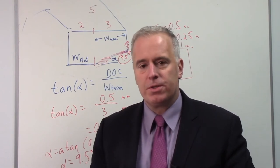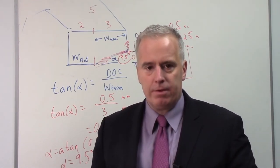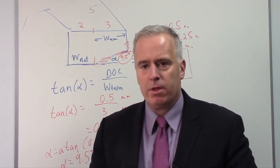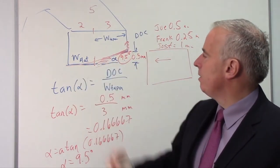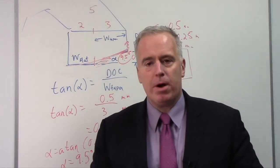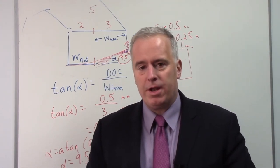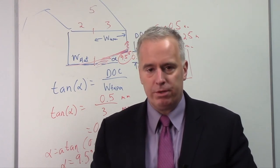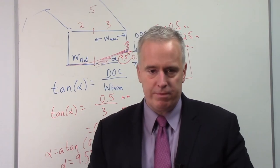I started doing this a couple years ago with my customers, and they like it. They true up that angle on their truing machine, and they're off and running. Eventually that will break in, but they're able to grind with more reasonable parameters and not this ever-changing taper on their cup wheel, which causes all types of problems in terms of uneven wheel wear and uneven temperatures.